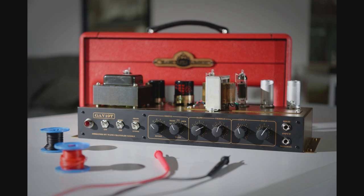The bias feature came about from wanting it to be able to sound different in different situations. You start looking at other circuits and you see, well, a Marshall's biased this way, a Selmer's biased this way. And I wanted to be able to treat the preamp section differently from the power amp section.